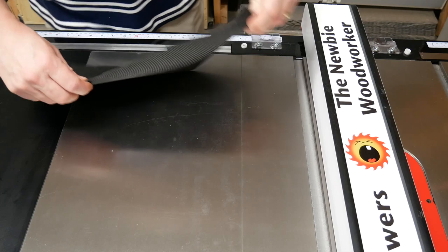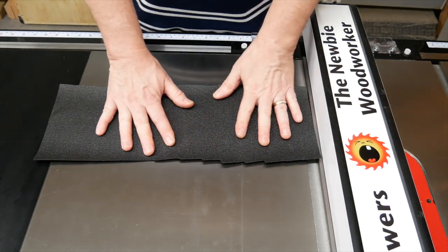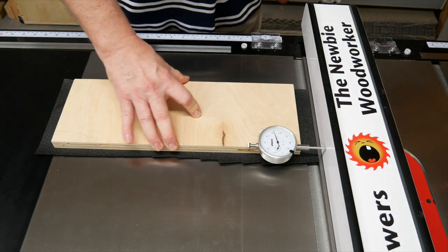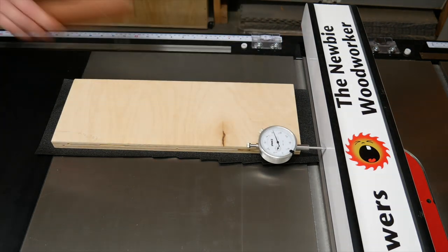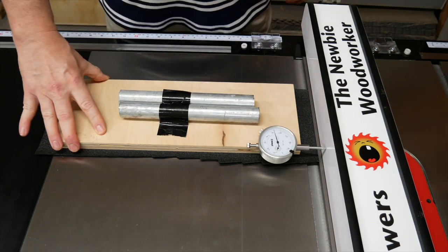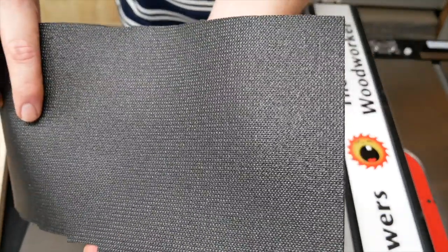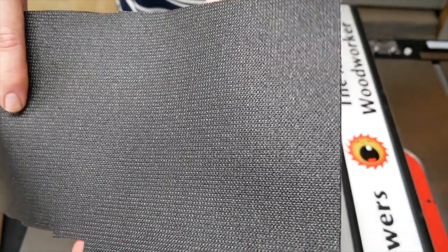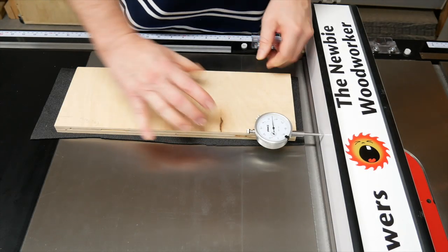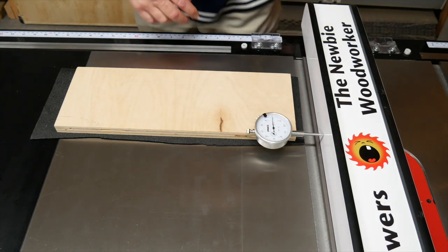This stuff is great. If you put some pressure on it, it really doesn't move much at all, even on this relatively smooth cast iron top. So when I put the scrap wood and gauge on it, it stays pretty much in place. But if you have any issues, you can put something like a brick or some pipe on it. If you decide you want to attach the liner to the wood, don't use glue — glue just seeps through the pores and it actually ends up more slippery. But this works fine as it is. I said it wasn't pretty, and I was right. But who cares? It works!